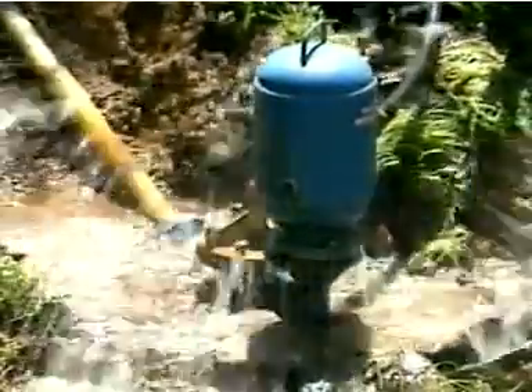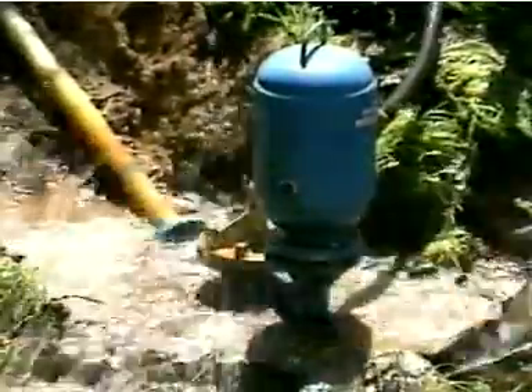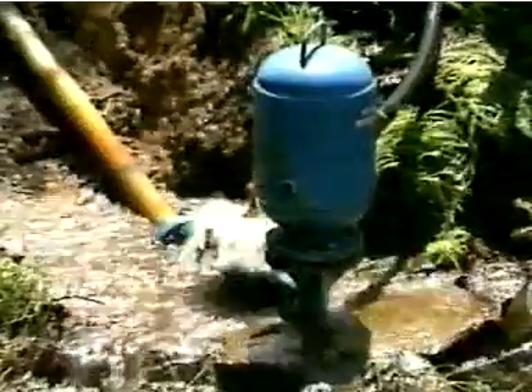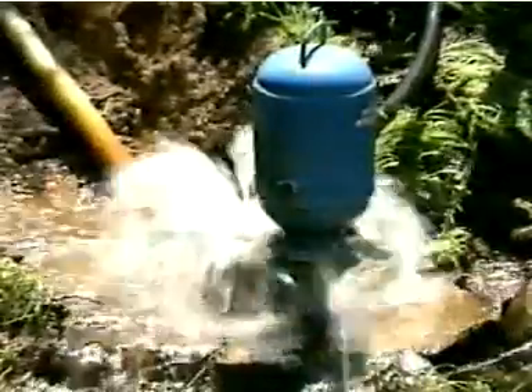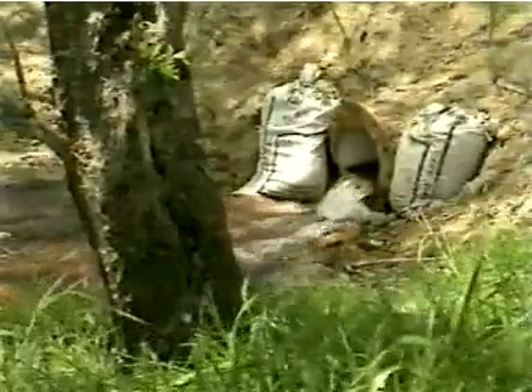And it's this development that makes it possible: the Williamson Automatic Ram Pump. The big advantage of a Williamson pump is that it uses natural energy that would otherwise go to waste. For anyone installing a Williamson pump, this is the first requirement — an adequate supply of water. The flow available needs to be at least 20 times greater than the volume you want to pump.